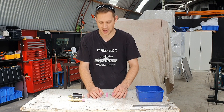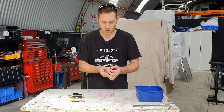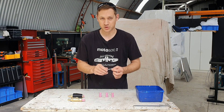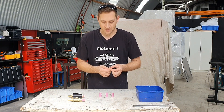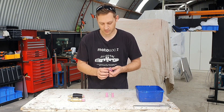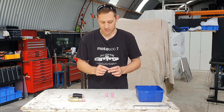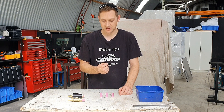You shouldn't have too many issues doing it by hand. What you're going to use is just one of these little diamond drill bits — use the core type rather than the pointy-end type, which is more of a glass drill. These are used for glass or ceramic tiles, that sort of thing. When you've used them a few times they end up a little undersized — this one I measured just before is actually about 7.8mm. That still gives it a bit of an edge. When brand new they'll go to 8mm or usually a little bit over, so that's just something to keep in mind.